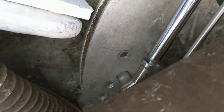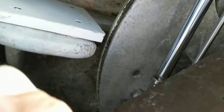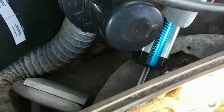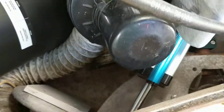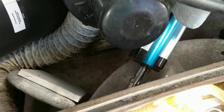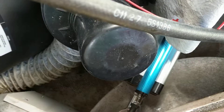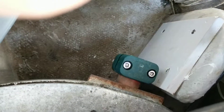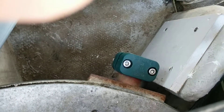To get that autopilot in, I ended up having to put these stops in, because you don't want the end of the piston to be your stop — you want to have a mechanical stop. So I ended up putting those stops in, just made them out of starboard. And then I also put a hydraulic hose clamp there just to give me that little bit extra.